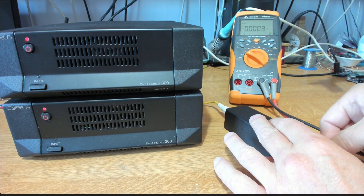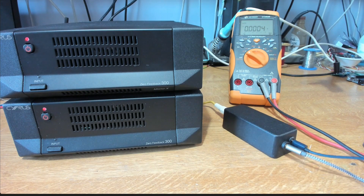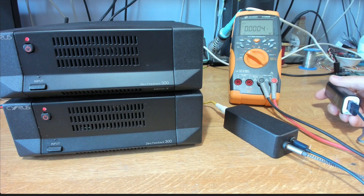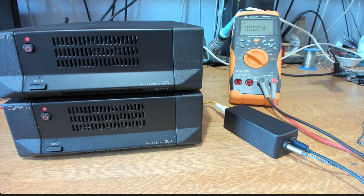At 5 volts the units power up and power down — working just perfectly. We can also use the USB-C connector. For myself, I like to power everything off at the mains and then flick one switch to power everything on — but my amps come up in standby, which is a real nuisance. So with a USB power supply plugged in, switched on with everything else, it will bring the power amps up. Using a power bank to demonstrate: I've included a 5-second delay in this version to give units the chance to go through their startup routine. It powers up, and removing the USB it powers down.